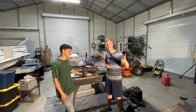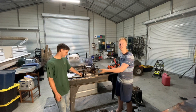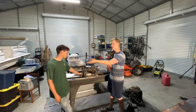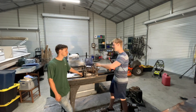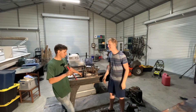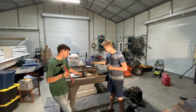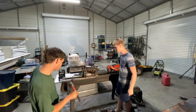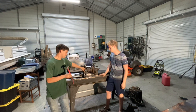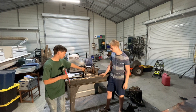Hello everybody and welcome back to the channel. I want to introduce Austin, my friend right here — he actually got the lathe originally. We believe it is a late 1920s Seneca Falls lathe. It is an 11 by 5 — 11 inch swing by 5 foot long bed. It's in rough shape; the headstock is pretty seized up right now, so that's going to be a big project.